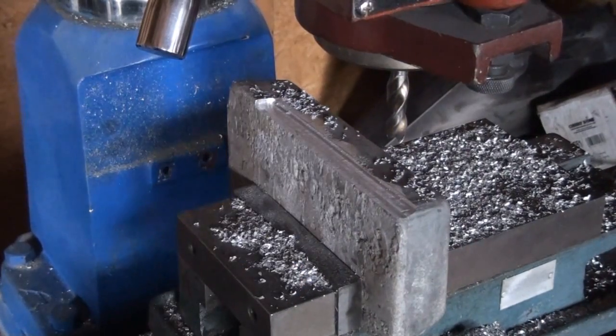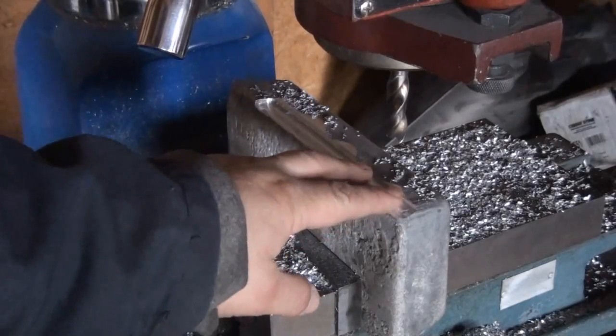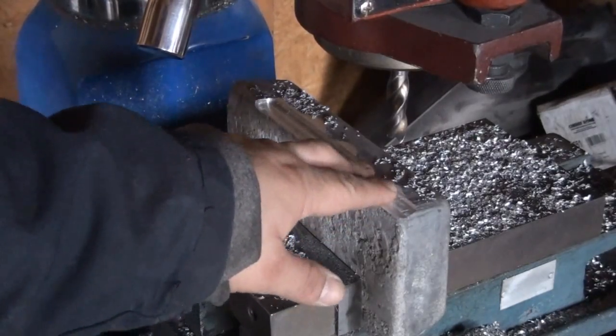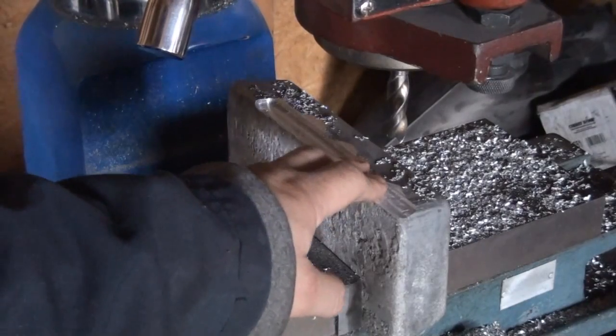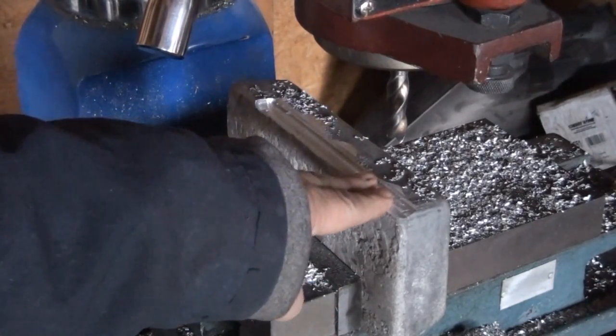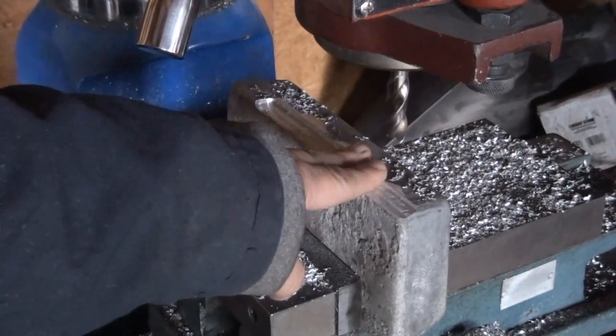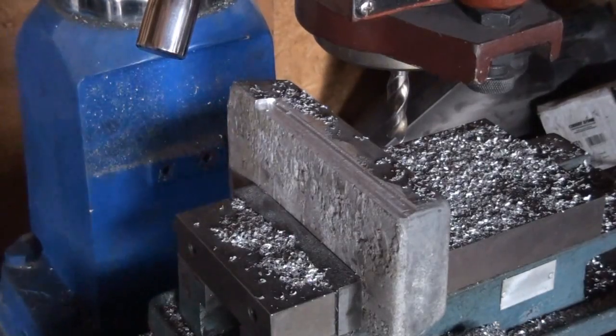It leaves a real nice shine when it's actually doing some climb milling — I couldn't really capture that on the video, but I can get a really good finish out of this. I've gotten a pretty good flat surface there. It's really good for plunge cutting, and I will demonstrate real quick some side cutting. I don't know how that might work out, but hey, why not?